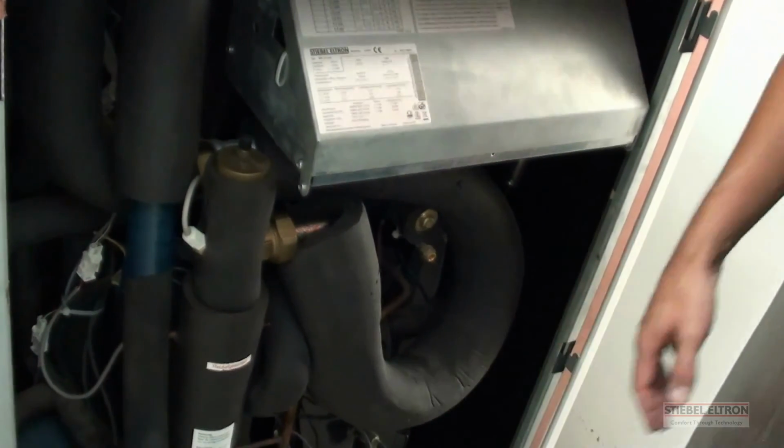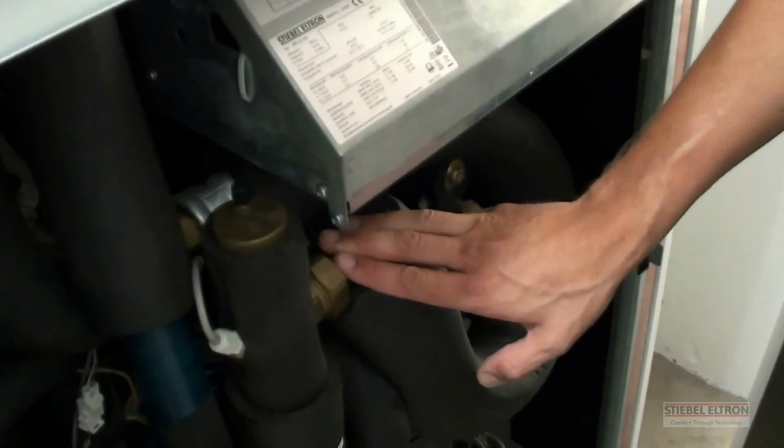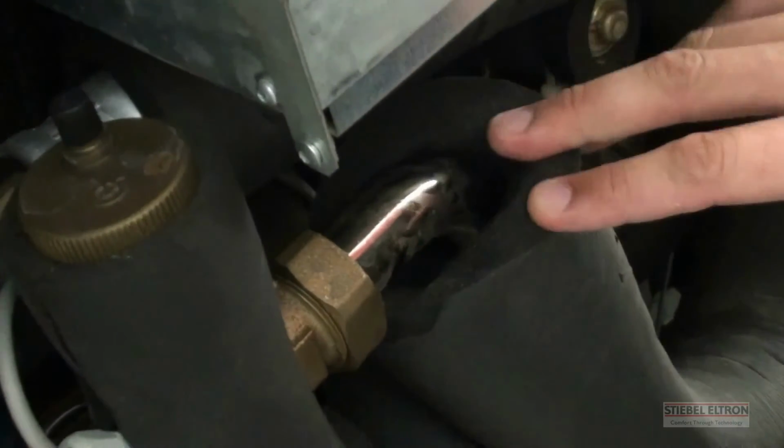another video. You can actually see the heat pump at the moment is busy cooling. You can see the condensation coming on the pipes here. You can see the water. You've got to lag all the pipes here with this insulation to prevent the condensation coming off. So at the moment it is busy cooling the house.